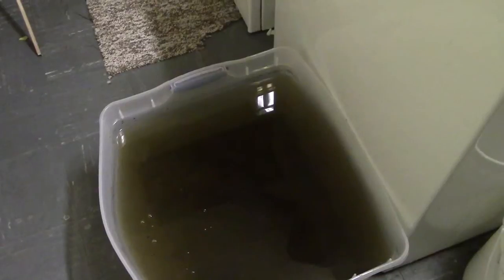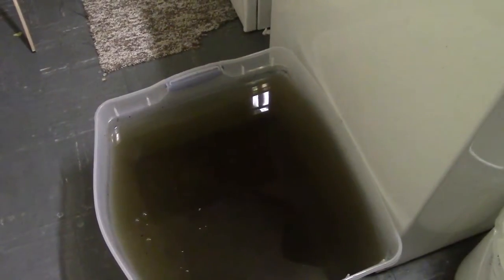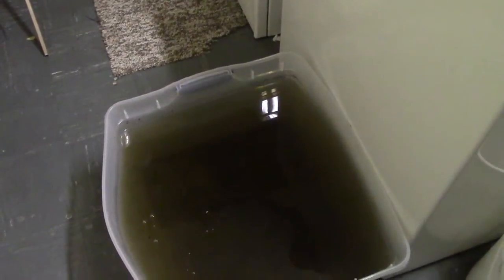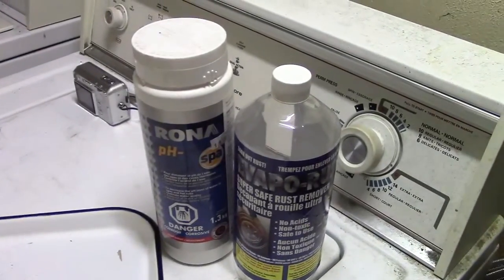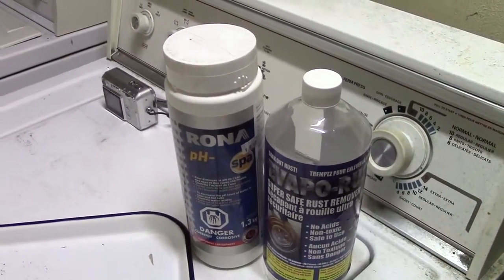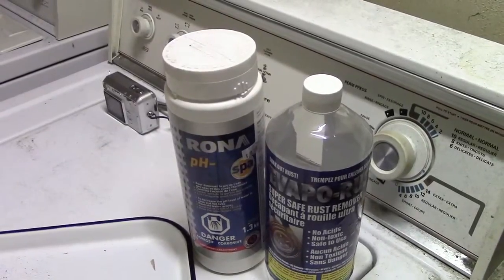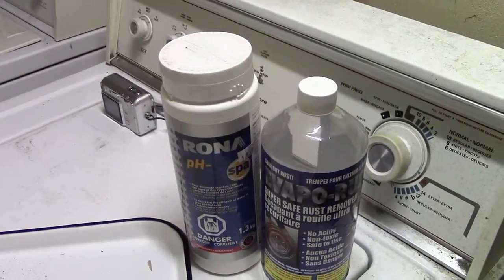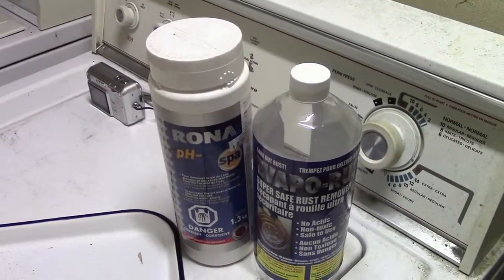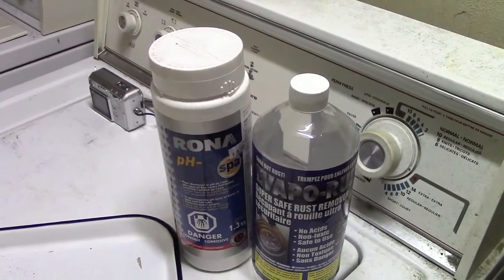It's not a good idea to leave metals in there longer than that, because I've noticed that it can start to cause a little bit of pitting if you leave it in for, say, 2 days. But that's usually not necessary. Once you get the bare metal, the major problem after that is flash rust, and that's something I've been trying to deal with: how to stop the flash rust from forming right after you wash off the acid. If anyone has any ideas that can help me out with this, I'd really appreciate it. At the moment, I've been immediately covering it in WD-40, which does stop the flash rust, but if you want to paint or do something later to the metal, you have to remove the WD-40, and this can pose a challenge.